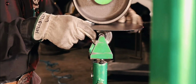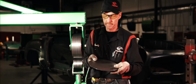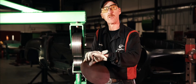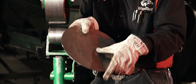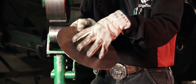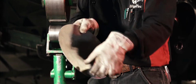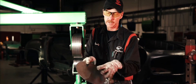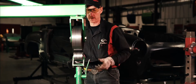The material where we're working in the middle here is being pressed down thinner. Now remember that we haven't done anything on this outside edge right now. This has been made thinner. This is still the original thickness. So what's happening is our structure, again the Legos, have started to try to find a place to go. This is changing shape, but it's held by the material around it. So this is referred to as an oil can. This is starting to take on a little bit of a shape. Let's add a little bit more to it.